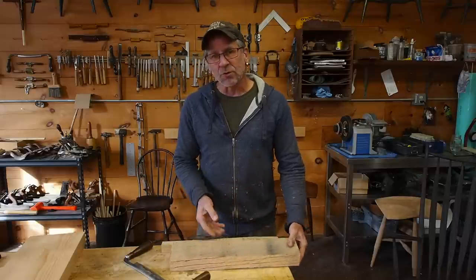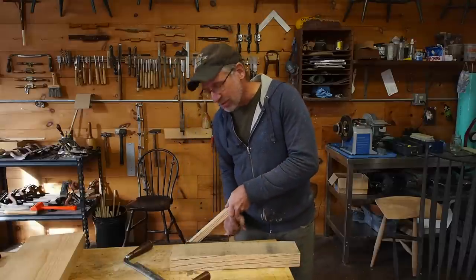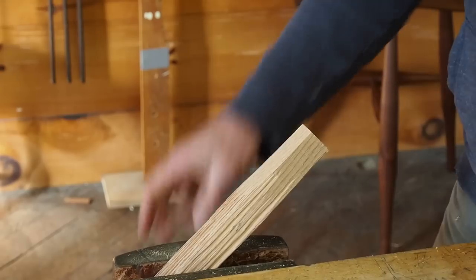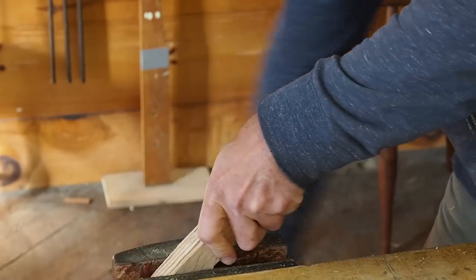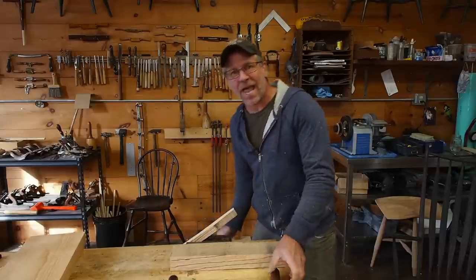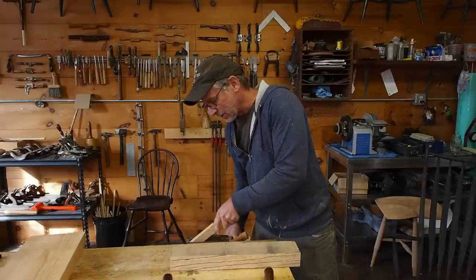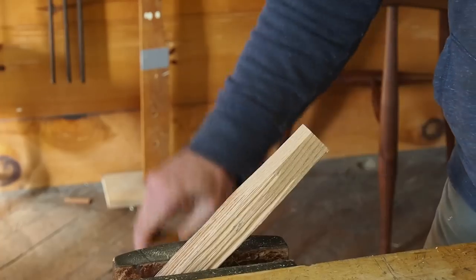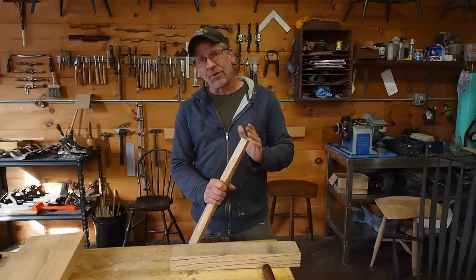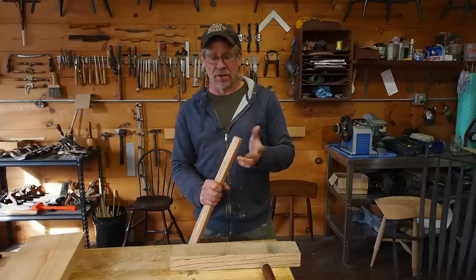So when I'm using tools, be it in turning or in shaving or shaping, it's really handy for me to be able to cut the same direction on any face, knowing that the only rule I have to obey is the thick to thin rule. So as I go around this piece of wood, I can just cut knowing full well that I'm not going to find myself having a splitting action as I go, regardless of which face I'm on. So if this was on the lathe, or if I'm shaving it with a spokeshave, I know exactly what to do. I always go from the thick portion to the thin portion of my shape, and I'm always going to get clean results. That really makes hand tools incredibly effective, and when you're turning on the lathe, it's always going to give you the very best surface quality off of the tools.